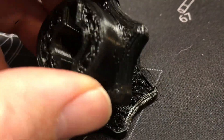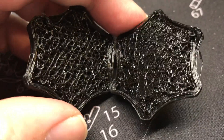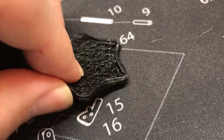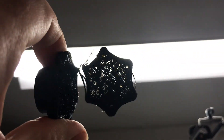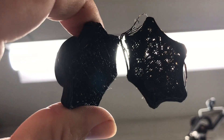I had aborted prints and then finally this. I thought it was maybe an XY axis issue, but no. I cleaned it, oiled it, checked my belts, and I was getting this kind of product that you can see light through — and that's with four layers on it. I deduced that it was the hot end that needed swapped.